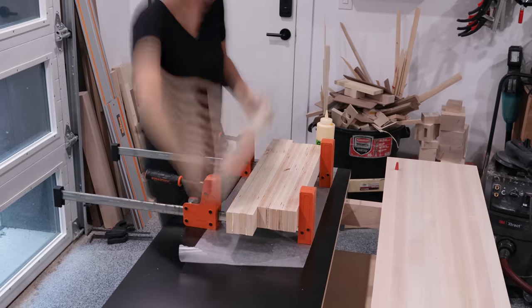The pieces were ripped oversized before gluing so that after they're dry I can clean up one edge at the jointer, then get the exact height I need based off of the top and bottom against the hardwood portion of the bench, then trim to final height. With the perfect height already set up at the table saw, I'll rip the rest of the parts that make up the supports of the torsion box, and cut most of the parts to length at the miter saw.